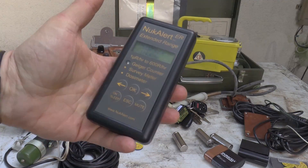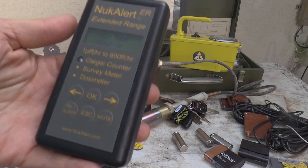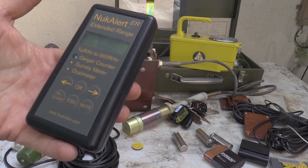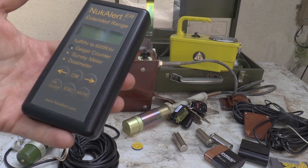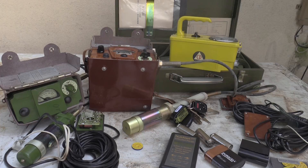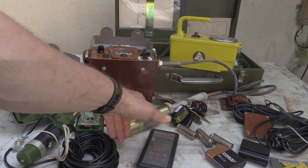For Shane's device, they use some electronic gadgetry to measure what is called 'time to first count.' The computer in this actually uses the same GM tube that's in your low level geiger counter, and those geiger counters - even the most expensive of them - will blank out at high level radiation. The tube they use, the SBM-22, primarily the SBM-20, and all of the other tubes like it, have a statistical top of counts per minute that they can count, and it is nowhere near what you will encounter in a true radiation event.